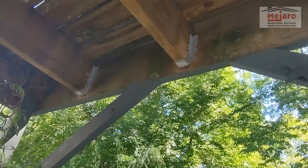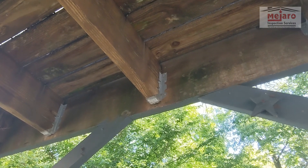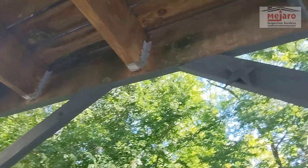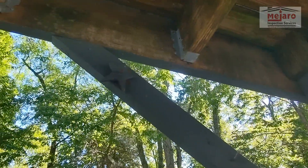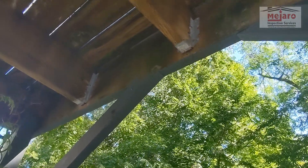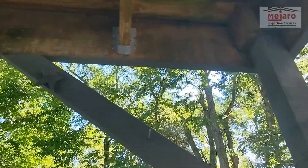Also up here, if you take a look at the floor joists, you can see nails put into that, which is great. I think I see nails in every hole and they're tacked in. The joist hangers are tacked into the wood, but we do see a lot of rusting nail heads, which is something we don't want to see.